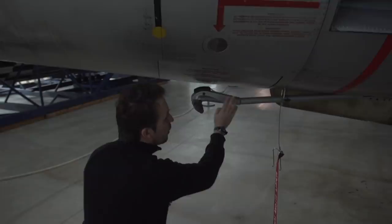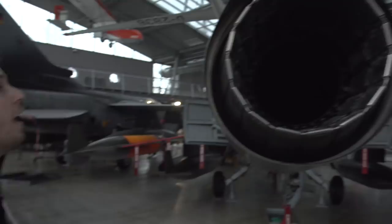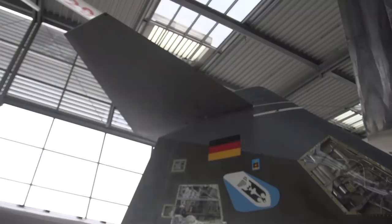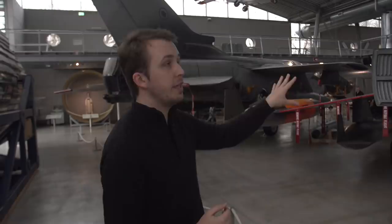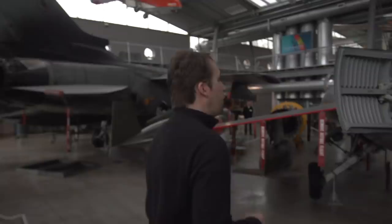Then we pan all the way up top to the horizontal and vertical stabilizer. We have the rudder and then that one massive one-piece elevator that the aircraft has. What is interesting about the F-104G that we have right here is that the tail is slightly bigger than on the earlier versions. This is because the trainer versions of this aircraft already had this larger tail, and eventually it was realized that installing it on the single-seat variants would be beneficial as well.